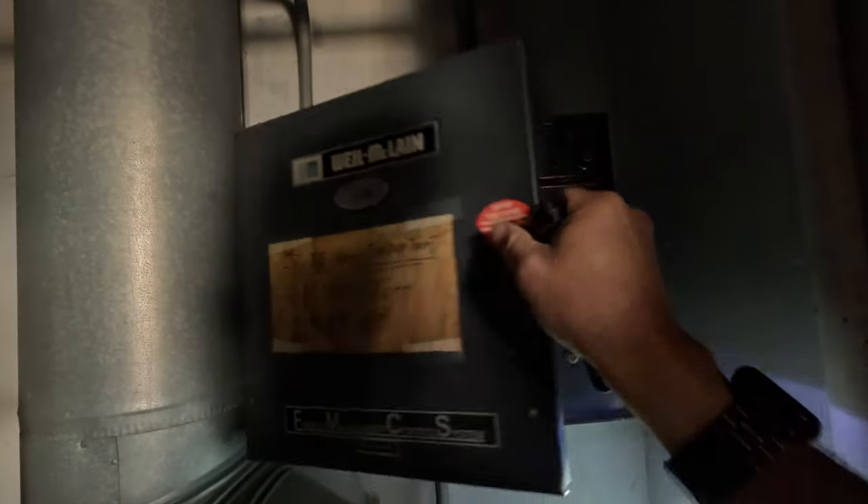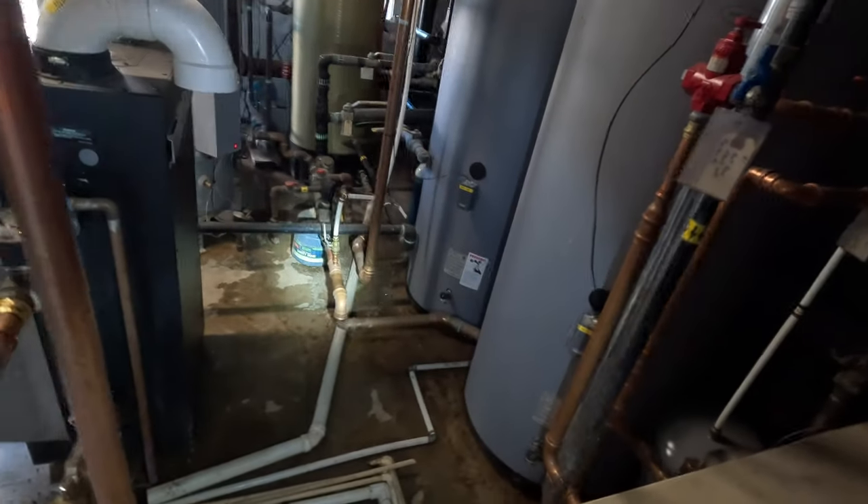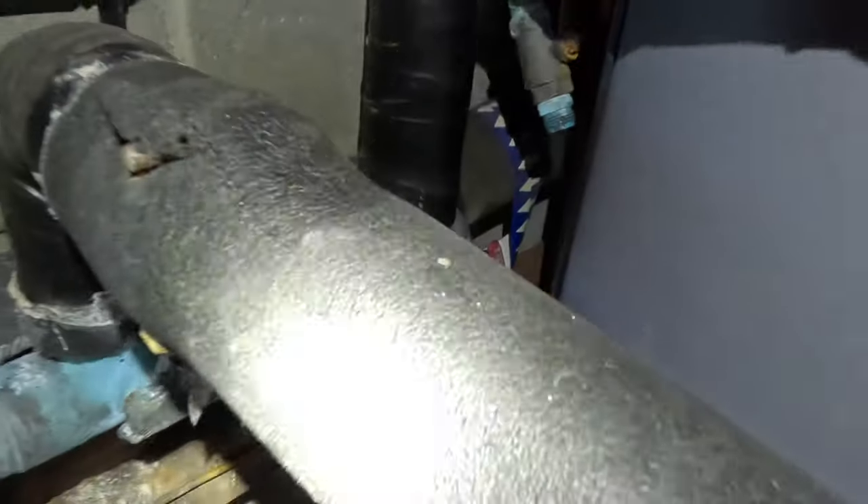It was supposed to get updated but they sold the place. The water on the floor you see there is from me draining it down - it could have gone to a hose but they got a floor drain in here. What we did is closed those ball valves, you have a feed and bleed right here. I opened both of those up and that let the pressure off, and those lines go out to the chiller. What we're going to do is blow nitrogen through both of those - that's going to blow it out to that heat exchanger and blow the last remaining bits out. We've got the hose right here, we're going to open that up and blow it out, wrap a rag around it, and we'll pretty much be done.